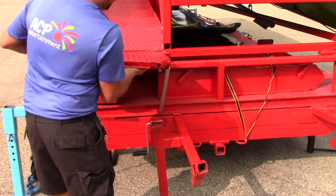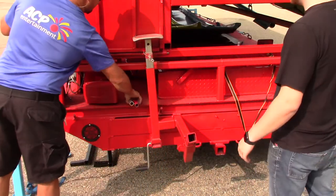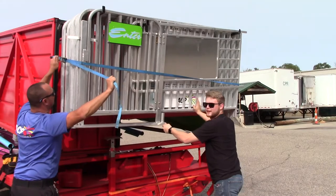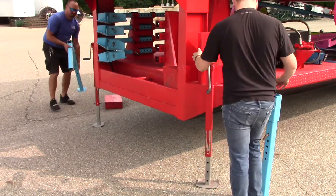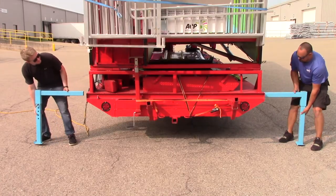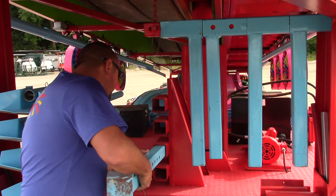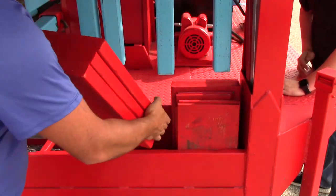At the bottom of the slide, remove and store the support rods holding the stair platform and secure that by flipping the stabilizer jack on the support arm upside down. Strap the arms, jack, and platform into place. Next, install the fence brackets and then the fencing. Once all fence is installed, strap it down. Using the stabilizer jacks on the front of the trailer, lift the nose of the trailer up and remove the blocks of wood and leveling jacks. Once removed, lower the front of the trailer to loosen the leveling jacks at the back of the trailer. Remove the leveling jacks on the back of the trailer and bring them to the front for storage. Store the leveling jack arms first and then secure with the pin. Then install the jack feet. This will take a staggered installation with the first and third going first, then the second and fourth. Stow the wood and secure it for transport in the chain bin.